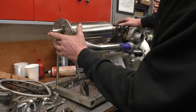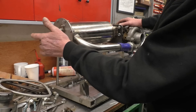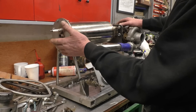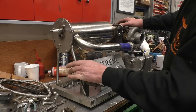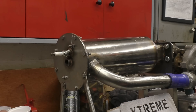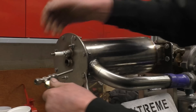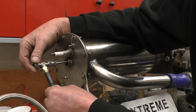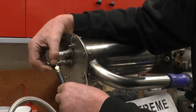The part I want to make now is an adapter that goes in there to take the actual injector for the gas. The gas injector is dead simple — it's a bit of six mil stainless steel pipe with some little holes drilled into it. I've done these before, they work quite well. I found a nice piece of braided hose that's going to go through an adapter in there and it'll be able to slide in and out to get in its best place, probably a brass adapter with grub screws to hold it into place.